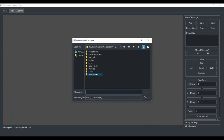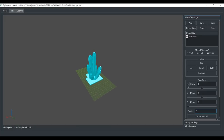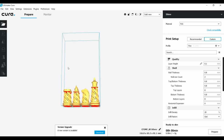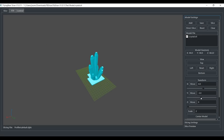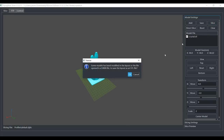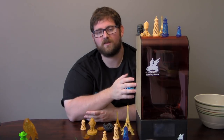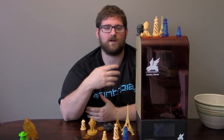Slicing models for the Shine is handled through the Flying Bear Slicer, which is a pretty bare minimum slicer, and it's not without its quirks. I found it particularly difficult to place multiple copies on the build platform — and filling the build volume as much as possible is something you'll want to do with resin printing. What I ended up doing was creating a Cura profile with the same build volume, importing my models, positioning them, and saving the entire build platform as a single STL. Another quirk: if you move, resize, or reposition a model, it requires you to resave the STL before you can slice it. If you're reprinting the same models on different printers and you've resized for this build platform, that becomes the new default size when you import the STL. I ended up making backup copies of my test models and storing them separately so I wouldn't interfere with future prints.